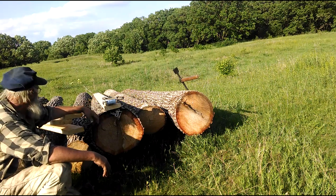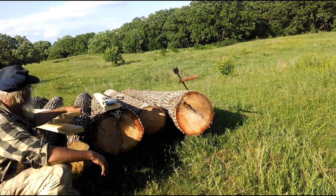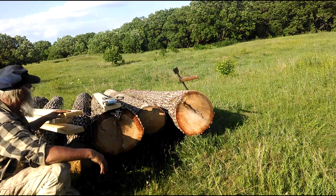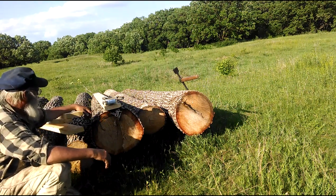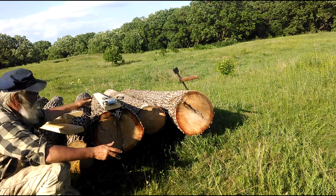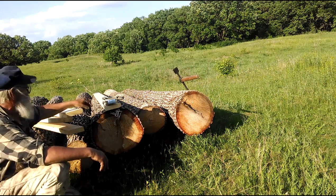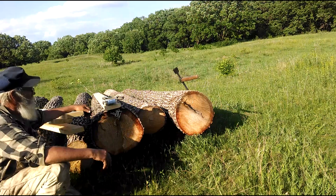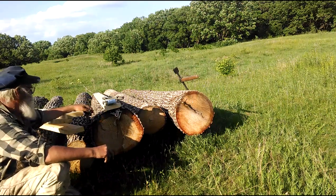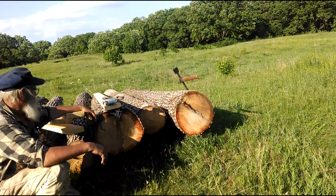But that's what the frame lumber is for. It's an aggravating thing trying to find good lumber in the lumber yard, but I picked out four straight as can be anyway — as good as I can expect them. I could make my own guide board, but if I was to cut that nice of a 2x6 out of ash, I would have better uses for it than a guide board — they get broken up from driving nails in and then pulling them out. The only alternative would have been to use a piece of channel iron, like a 6-inch channel and run the saw on that. But I think that'd be a chattering and vibrating thing, so I think this will work for what I want it to do.